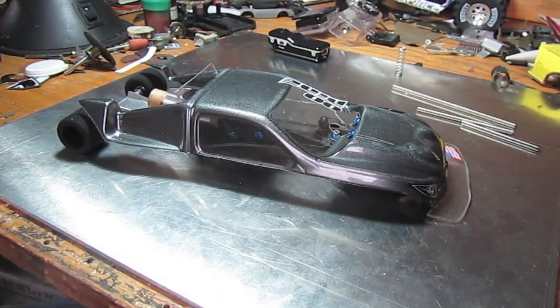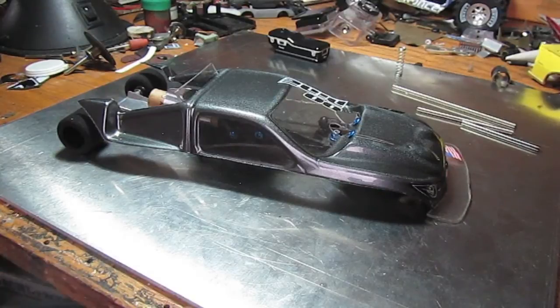You could use a plastic model car body or something light. Generally, if you use an A10 engine, you want to build a very lightweight vehicle and take a few things into consideration. Lightweight vehicles are generally a lot more finicky than a die-cast car, but they run a very short distance and go very fast in that time. If they do crash, they generally don't break because they're so lightweight, and if they hit something or somebody they're not going to hurt them.